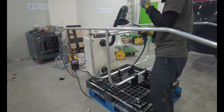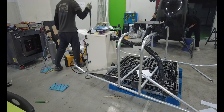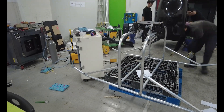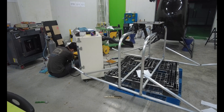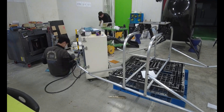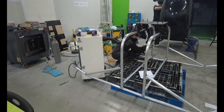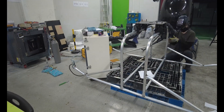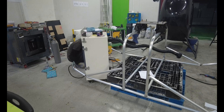Now it's time for full welding. Aluminum is just crazy when it comes to heat — too much heat and it twists, not enough heat and there's no fusion. Too much and you get a big hole. Long seams always end up twisted by the time you're done. So it was: full weld, check dimensions, scream internally, cut and fix, repeat forever. Sometimes I seriously thought maybe it'd be faster to just start over.